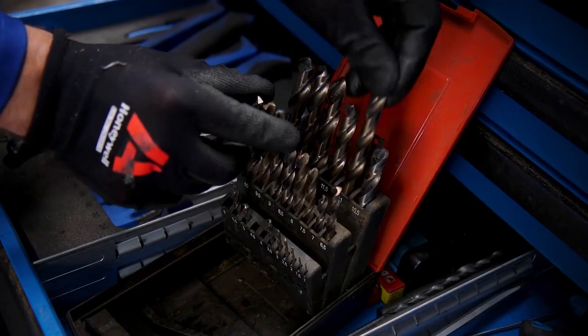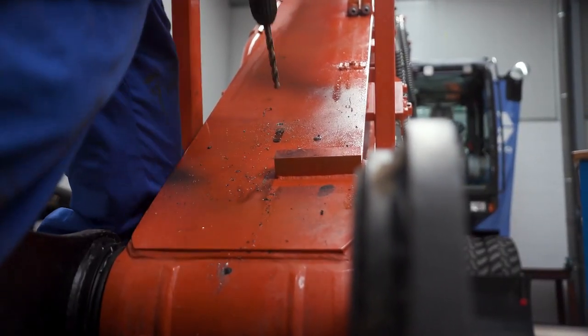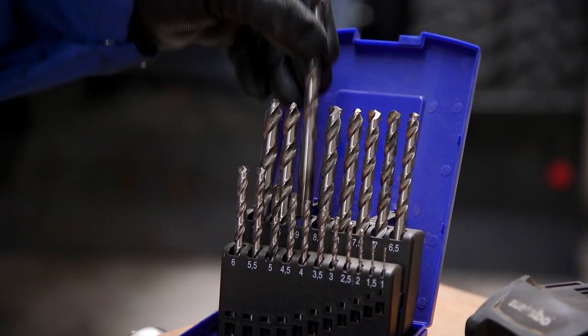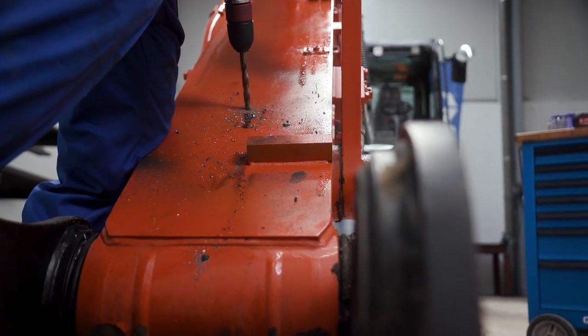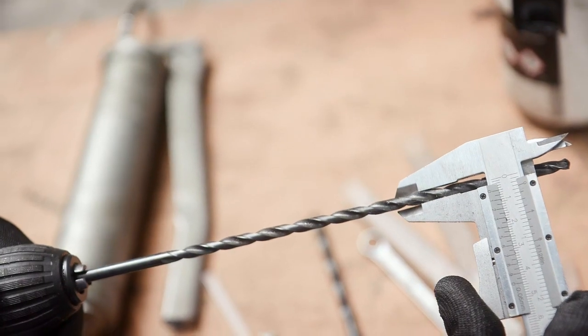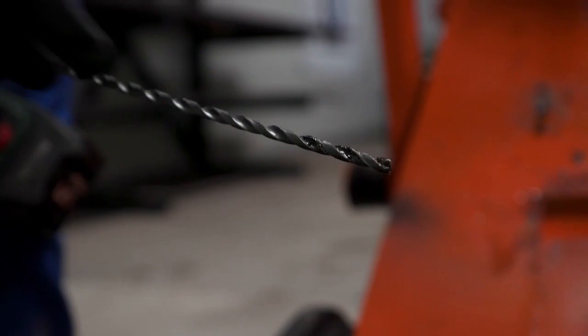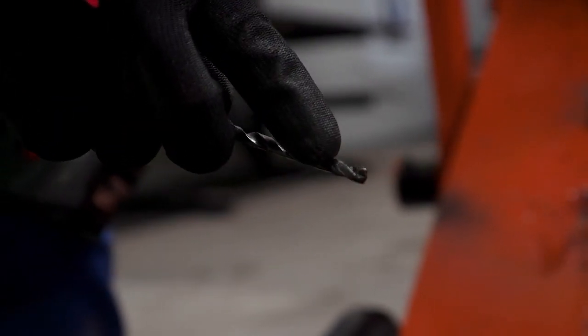The installer progressively increases the lubrication point holes until they meet the desired size for future component installation. This may take several attempts until the desired hole size is reached. The installer then uses a longer drill bit to penetrate the bucket link pin cavity, which is located inside the casing of the stick.